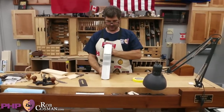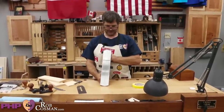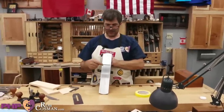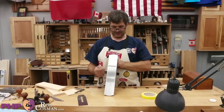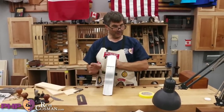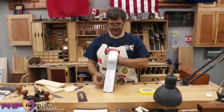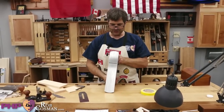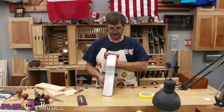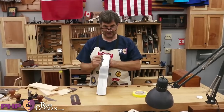I said, "Do you see anything wrong here?" "No." "Really? Look again. It's shiny." "Nope." I said, "How about right here? What do you see right here?" "I see the blade." "And what do you see over here?" "I don't see anything." "Okay, remember, we have to see the same amount of blade side to side." "Oh, yeah." I said, "Now you watch, and I'll start pushing the lateral adjustment lever. Do you see it move?" "Yeah." "Okay, what we have to do is adjust that until that blade projects the same amount from one side to the other."